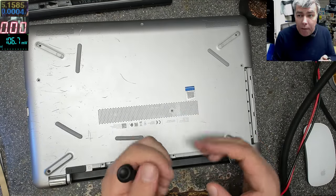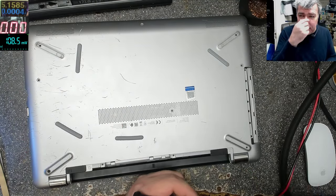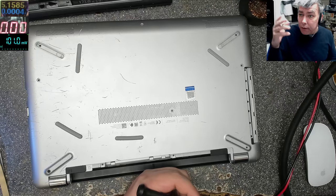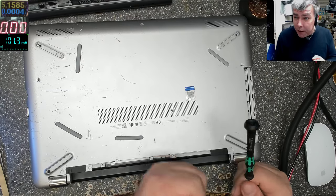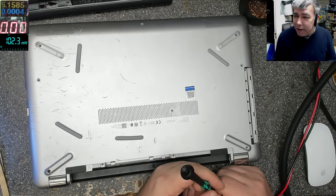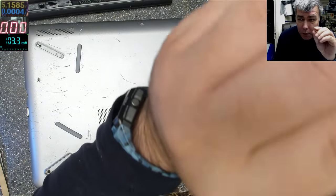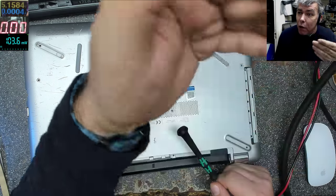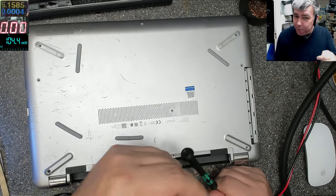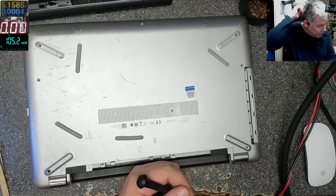Like they are keeping, you know, when the MOSFETs are switching, all that switching, yeah? Let's say, how can I explain it? If you have weak electrical wiring, yeah? You plug in a big heater and you see the light bulb, the light is going a little bit off, yeah? Same thing with the switching power supply, yeah? All that switching, a little bit of it is coming back on the main power rail, yeah? And that capacitor will send all of that to the ground.